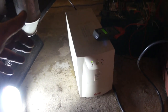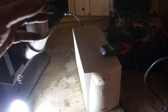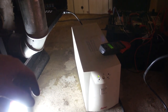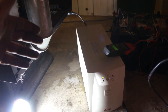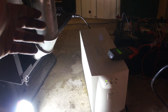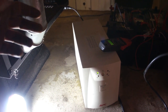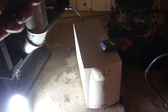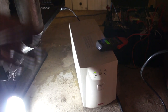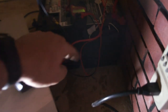The onboard batteries that these units come with are very, very small — smaller than the size of a tennis ball or softball. They'll only run the plugged-in unit for 5, maybe 10 minutes. What I did was I went into the unit and took the power leads, the positive and the negative, and extended them with 10-gauge stranded copper-coated cable out to a set of deep cycle batteries.